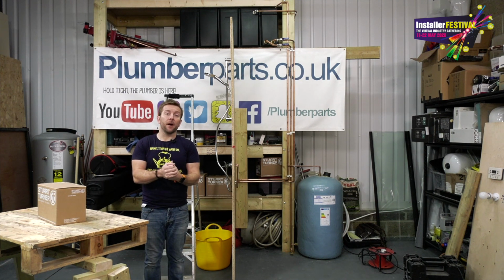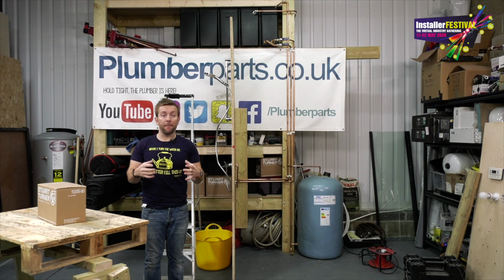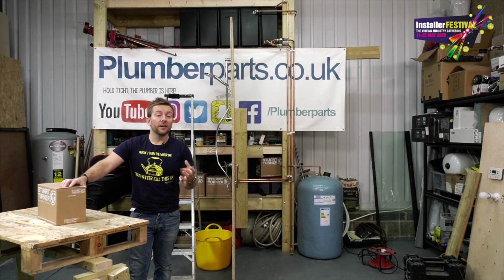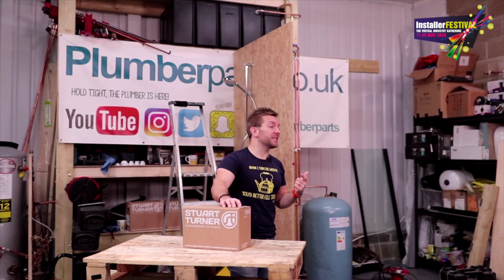A positive head pump relies on an adequate flow of water coming through it through gravity to initiate a switch to turn the pump on and get our pressure up. If you don't have that adequate pressure, the pump will not kick in. What you'll need to get instead then is either a universal or a negative head pump.